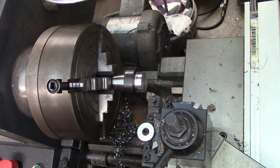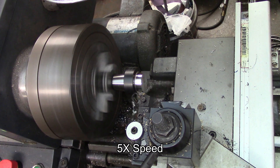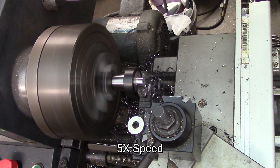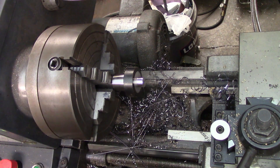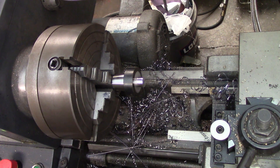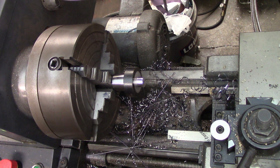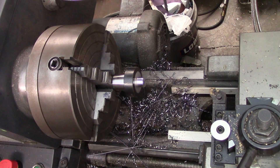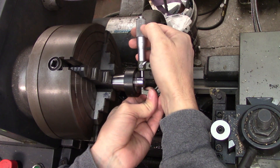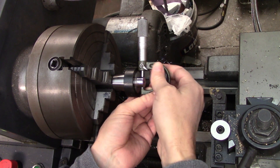That is definitely machining like hardened steel. On that last cut I pulled out rather than dragging across because I want to make sure I can get a good surface finish to measure off of. I'm going to let this cool down before I measure it — it's not burning hot but it's toasty enough that it would affect my measurement. Alright, this is cooled back down to room temperature now. We've got a pretty good size range so I didn't necessarily need to wait for full room temperature, but it's always good practice.